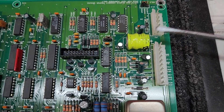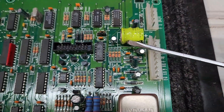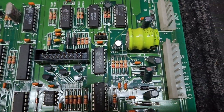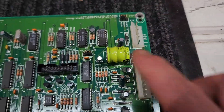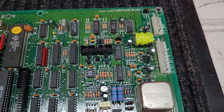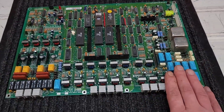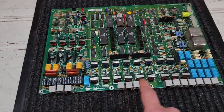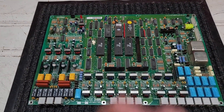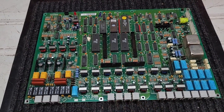You're going to have a battery right here — you're going to need to crack that guy off. The reason I say it's a battery is because you can see the positive in front of it right here, and it looks like a battery and stands out on the board. When something stands out on the board quite like that, chances are it's going to be a battery — you don't want that in your shop. This board I didn't care; I know it hasn't been plugged in for years and it's been sitting in the bottom of a bakery. So let's start getting some of this stuff off. I'm going to start with the relay boxes and these end connectors, and after that we may choose a different way to depopulate this after we remove all the IC chips.